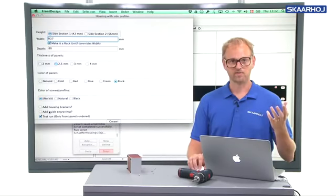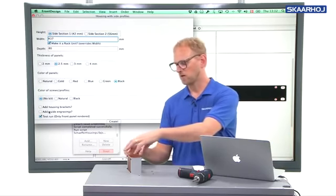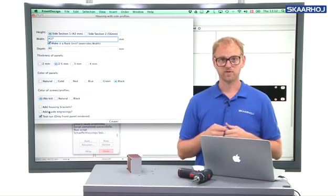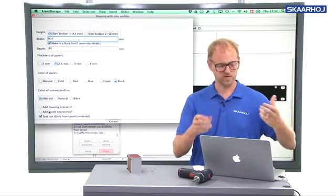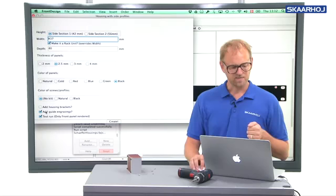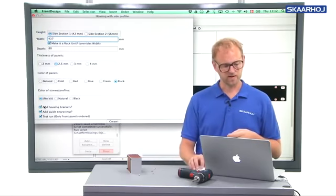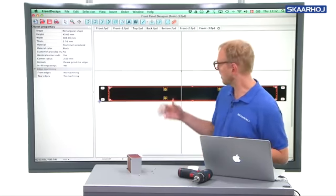Maybe I want to see guide engravings. Do you remember from the previous videos that you could have engravings that clearly show how, behind the panel, the profiles extend, and that's very useful if you want to place any type of cutout or a printed circuit board there, etc. So I'll add guide engravings again, and then I'll also add something called housing brackets. Housing brackets will help to keep the whole thing nicely together. So when I press create here,